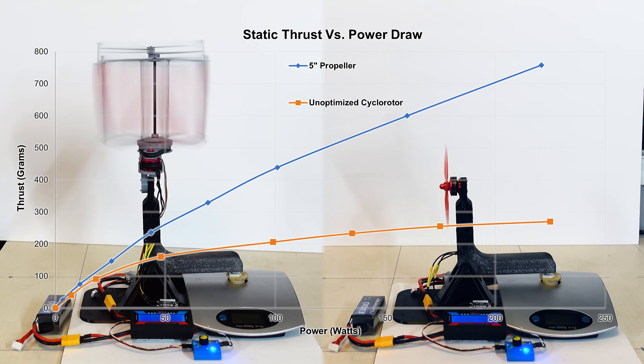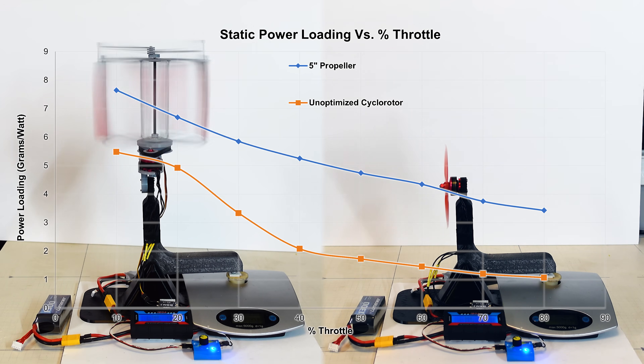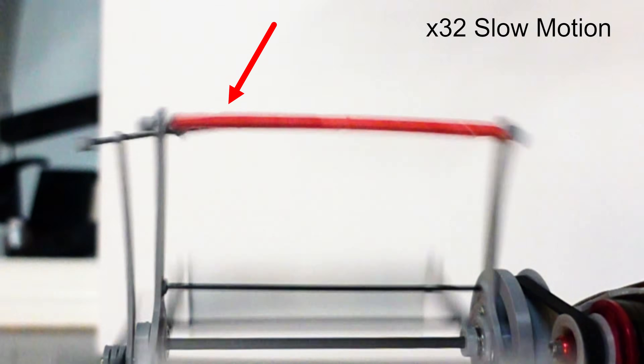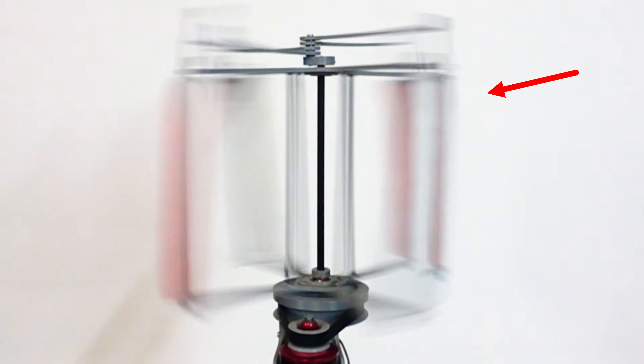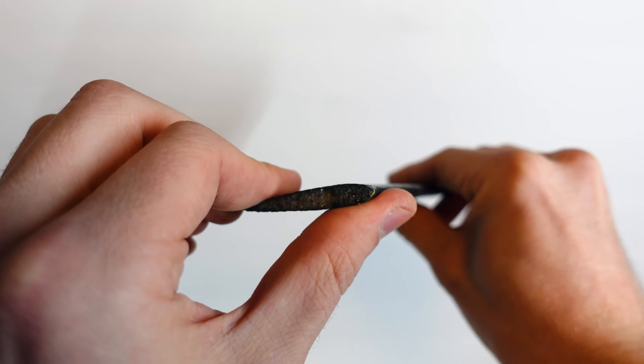This plot gives us a better idea of efficiency. For the same power draw, the propeller is producing quite a bit more thrust, which isn't surprising for my highly unoptimized cyclorotor design. Looking at power loading vs throttle tells us how much power it takes to generate a given thrust. We want to maximize thrust and minimize power, so larger values of power loading are better, and you can see my cyclorotor falls short compared to the propeller. There's also a weird dip at 30% throttle, about the same throttle setting where the thrust plot oddly leveled off. My best guess is that my fragile foam blades start to bend at higher RPM where aerodynamic and centrifugal forces are much higher. Bending the blades requires power from the motor, but their effective angle of attack is reduced when they bend, so they produce much less thrust for the same power. In the next cyclorotor design, I'll be sure to stiffen the blades up, maybe with some carbon fiber.